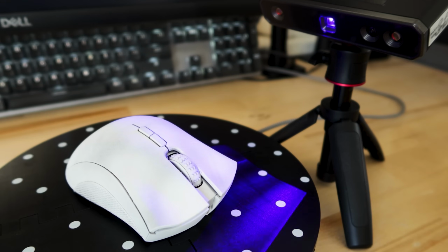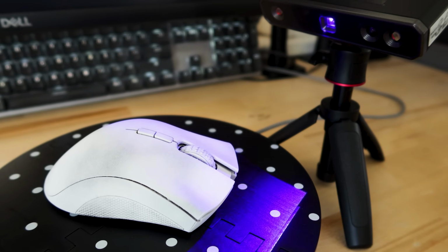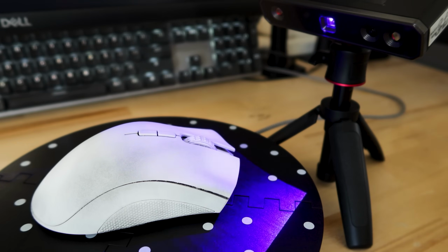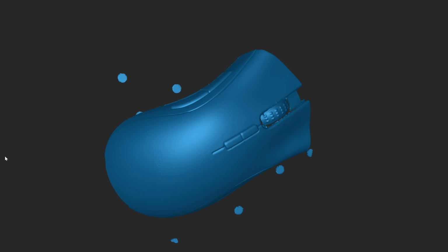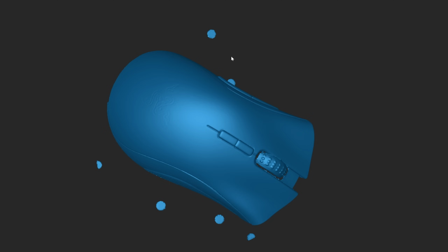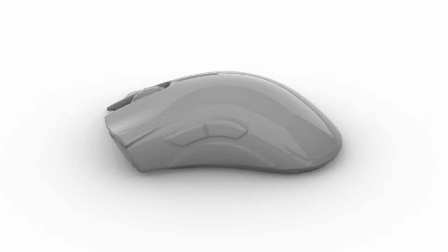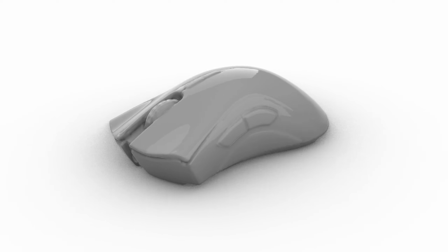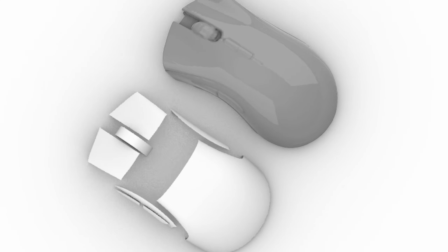I'm going to start the actual design side of things off by exploring my mechanical engineering constraints for the new Statial B. My first step is going to be to 3D scan in a standard mouse form. For this, I'm going to use a Razer DeathAdder Elite, which has been my default go-to productivity mouse for years now. It also has a relatively standardized form factor, so it'll be a good baseline size reference to use going forward. With my reference mouse scanned in, I'm going to model some surfaces in place in Rhino 3D.